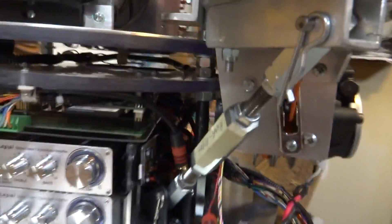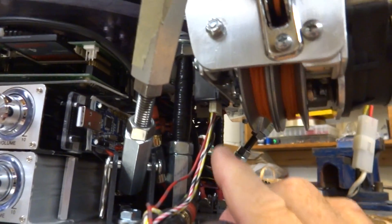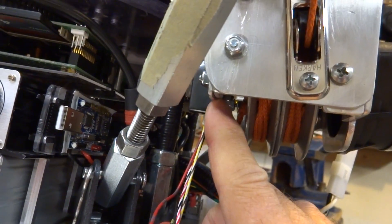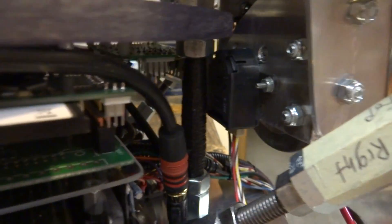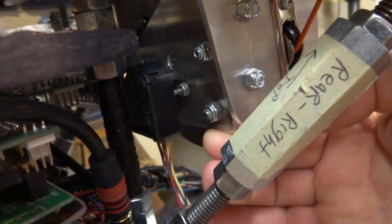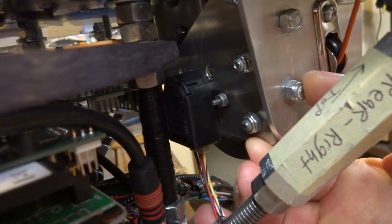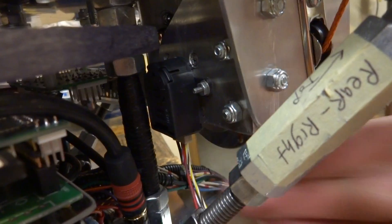The other thing is I've got a squeak down here. You can hear it. What that is, is my floating panel — because this is all handmade, I had to make this panel float — that the encoder's attached to. You can see it kind of wobbling back and forth. It doesn't destroy the encoder, but something in there is squeaking because I can hold that up and pretty much make it quit. I've got to figure something else out for that.